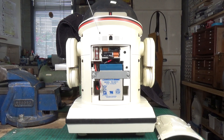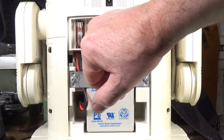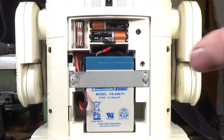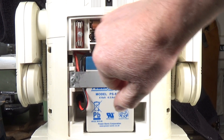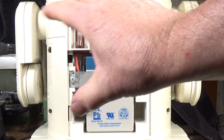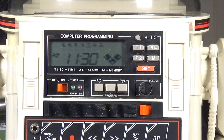The new battery arrived for the Omnibot, which I have now fitted. Fortunately you can still get the batteries for this. The contacts for the two AA's were, once I got the robot apart, far worse than I thought with the corrosion, so I've had to remake the contacts completely. It's just a matter of cutting out the right shape in a bit of brass and folding it up. Originally they were riveted to the plastic behind the batteries; I found that 8BA screws and nuts make a great substitute for the original tiny rivets. That's all been done and it all works nicely. Here's the front - we'll zoom in on the display. That's all now working - I've set the time up and it all works perfectly.